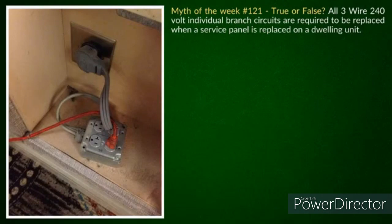Now, I will give you a little insight, sort of like when you go and look at OSHA. If I'm not mistaken, I think it's 50%. I'd go back and look to be 100% sure, but they deal with March 15th, 1972, and then April 16th, 1981. Those are the two dates that you're going to know, and that's when you started seeing them come in. They skipped from '71 to '75, and then it was 3 years after that, but they had a 4-year skip there. Well, that's because OSHA was wanting the NFPA to come in and get serious about taking care of commercial industrial. And they have a thing in there that says if you do a remodel where you're going to redo 50% or more of the area, then you had to bring it up to the current code at that time.